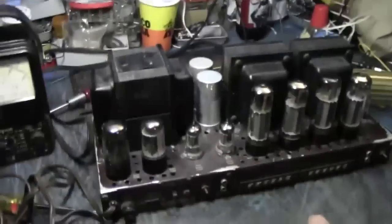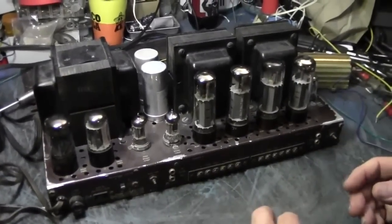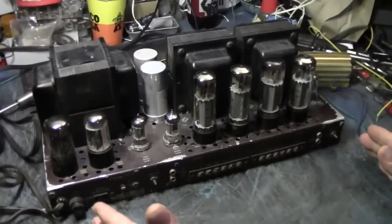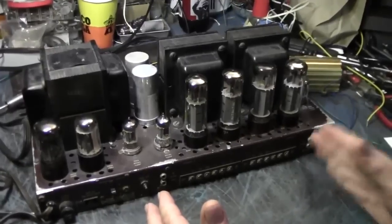You gave us a lot of good tips and tricks today. Yeah, this is a fun one. And I wasn't expecting to find an open cathode resistor. I was trying to verify that the resistor is good, and then we'll check the voltage. And I go, wait a minute, 5 and 50, either something's wrong or my voltmeter has gone out. No, the voltmeter was right. This channel had a problem.